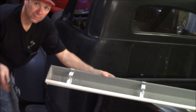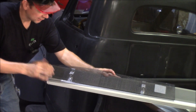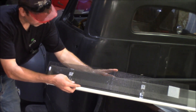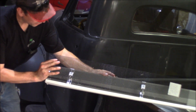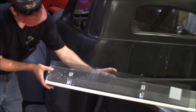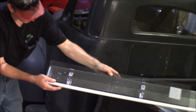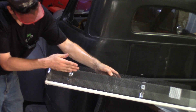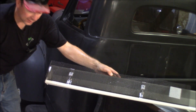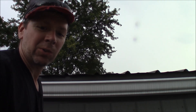You can see here's my gutter and here's the cover piece. Like I said, there's a detail on the end. Literally all you do up on the roof is slide this edge up under the shingles or under the metal roof, to the point where you can clip the front edge down under the lip of the gutter. My brackets are holding this up a bit, but it'll usually sit a little tighter. This edge is captured by the metal roof and this edge is captured by the lip of the gutter. It allows the water to run off the roof through the material, while leaves and debris will hit this and bounce right off — your gutters shouldn't have to be cleaned again. I'm risking life and limb because a nasty thunderstorm is coming in, but I'll go ahead and show you how to do one.